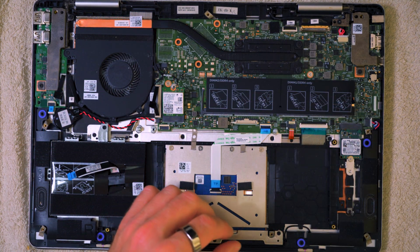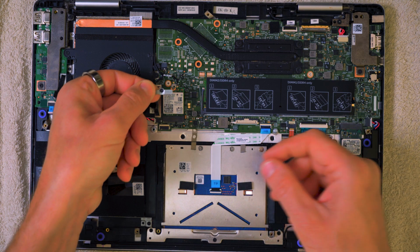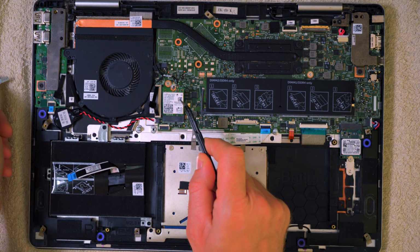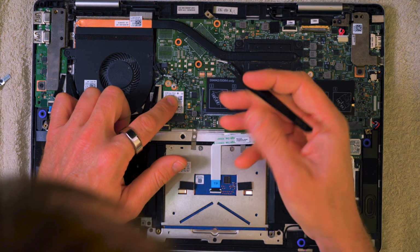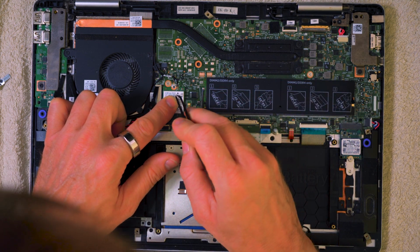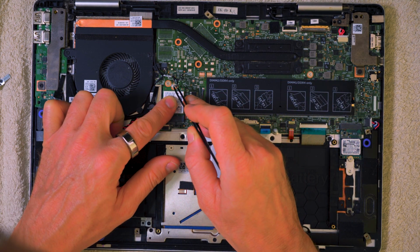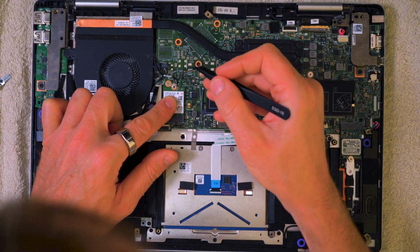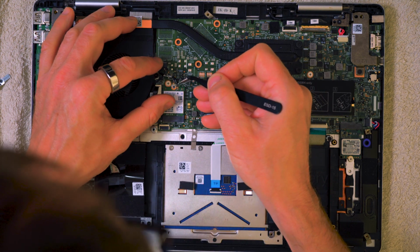And then on the Wi-Fi card, we've got this sort of metal brace to go across it, but you don't want to put that on just yet. You want to get the actual Wi-Fi antenna connections on first. Now you hear that click as I put it down? That was the screw thread here, just locating in that sort of cutaway on the PCB just there. That's nothing to worry about. That's what you want. You want that to be located well.